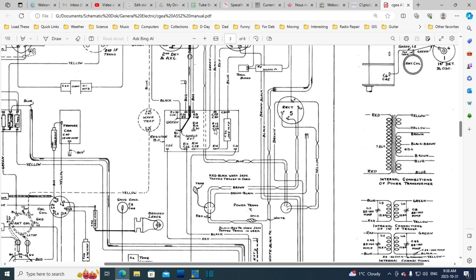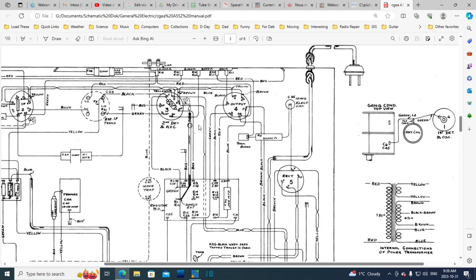So here we have a resistor, and then we have one on an angle. Here we have a resistor, and then one on an angle again. And the big capacitor is supposed to connect here. That would be C30. C30 go here. Well, see, this is the same point. So it could go here, or it could go all the way to here. I could put a C30 from here to here, or here to here. Wherever I like. C30.